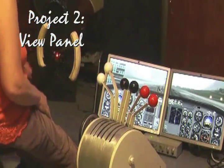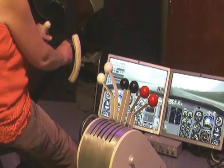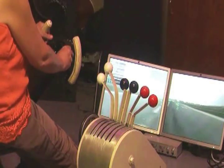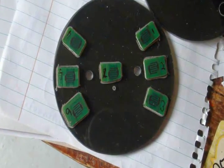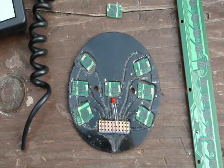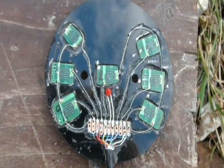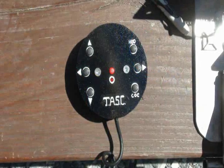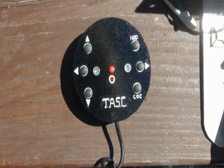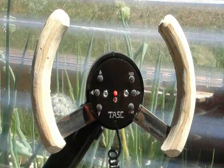As an add-on and additional pilot control, some sort of view buttons must be mounted to the steering wheel. Sometimes one needs to look left or right, or remove the cluttered gauges for a clean view while flying. A gutted toy keyboard seemed a good choice for parts. The button pads were broken up to fit the new round shape, then embedded into some plexiglass, wiring and all. I had some old Rock Band drums I'd pulled the board out of and saved — it's like a joystick but only buttons. Perfect! The board was cut down and fit inside the steering head, then the button panel connected using a heat-coiled cord. Mounted in place with some hand-drawn graphics, it looks not bad.